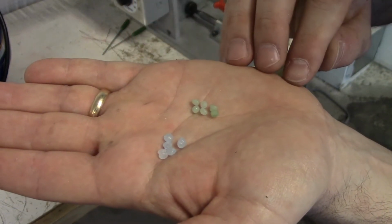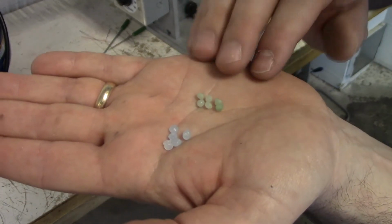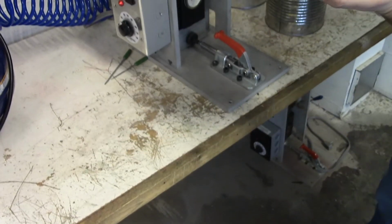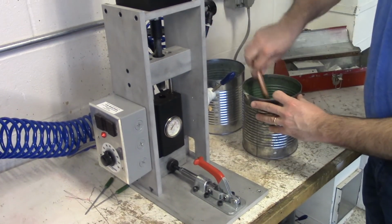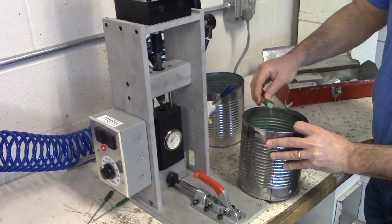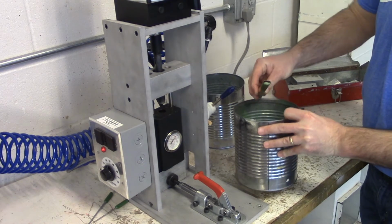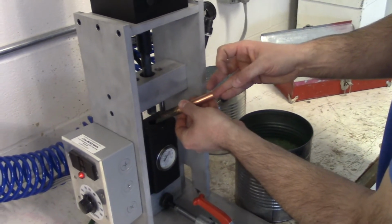Some students ask, what color pellets do I need to use? These colors change weekly. It's not the color, it's the density. So again, high density for the golf tee, low density for the screwdriver handles. This tool makes it really easy to carefully fill my hopper, trying not to spill my plastic pellets all over the place.